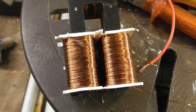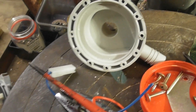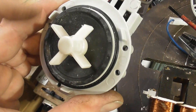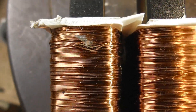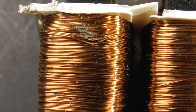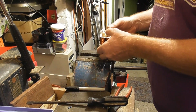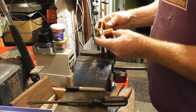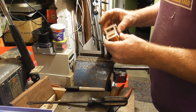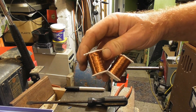Let's see if we can fix this coil. This comes out of a washing machine motor - it's just a little pump and I've taken it apart because it stopped working. There's a little stepper motor in here which is actually quite cool, and I just noticed there's damage here. I don't know how that could have occurred, because it's normally in a pretty safe area against the pump housing. I managed to prise the core off with some wiggling. It's quite interesting - it's actually a flip coil type thing. I'll work out the number of turns I need to replace to fix it.